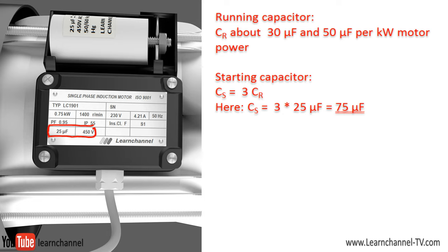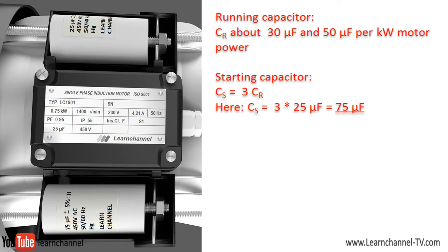As you can see, this is a very rough estimate. The reason is that the size of the capacitor depends on the motor power and the winding ratio of the working auxiliary winding. Thus, it is very difficult to determine the capacitance — it is best to contact the manufacturer. The starter capacitor, if it exists, is about three times as big as the run capacitor.